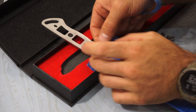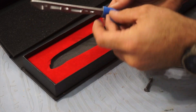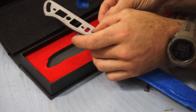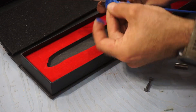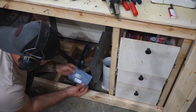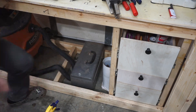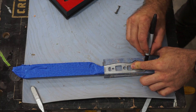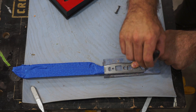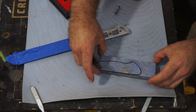I make sure to get that painter's tape as close to the edge of the bolster as possible to prevent any excess epoxy from leaking there. Not a necessary step, but it does extend the life of your sanding rolls later. Then I dig through my knife handle toolbox for some beautiful blue stabilized maple burl from Ryan Moeller. Once I get the knife blank and handle oriented how I want it, I trace it with a sharpie so I know where the specific wood features will be, like the eyes and the burl. I just use a sharpie — it's all going to get sanded off later, and it's easier to see.